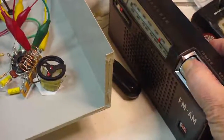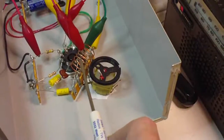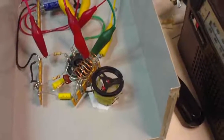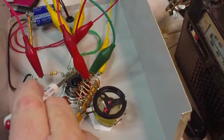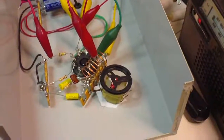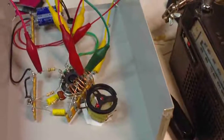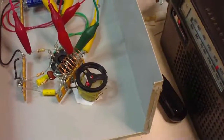There it is right there. Now that hum could be from the power supply, but more than likely it's coming from the tube itself actually modulating that. In other words, I've got an impedance mismatch or an open on a grid, and it's just picking noise up out of the air and modulating it on FM right now. But this is a biggie — just getting it on the air is a real good start.